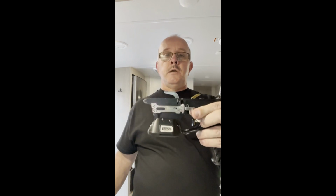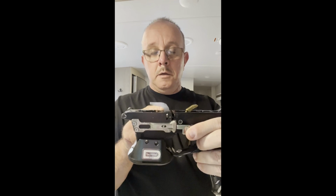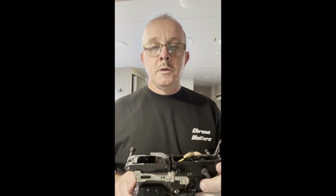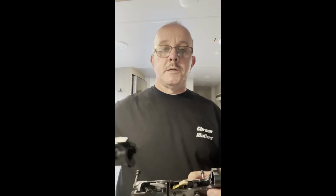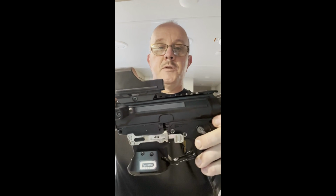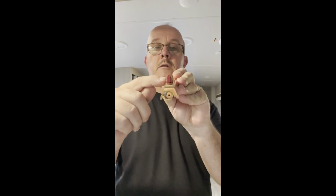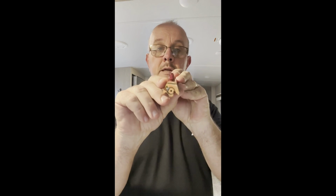So what does ejection on a PCC look like? On a PCC, your ejector sits on the lower. That means there are several things you want to pay attention to, especially as you're putting more wear and tear on the gun and running it quite a bit. The first nuance is the slot between the upper and the lower. That's going to open up your tolerances. Then as your bolt is traveling in the bore of the upper, it's going to create tolerance issues. And on the gas key, as you wear, it allows the bolt to rotate more, and so now you've opened up some tolerances there.